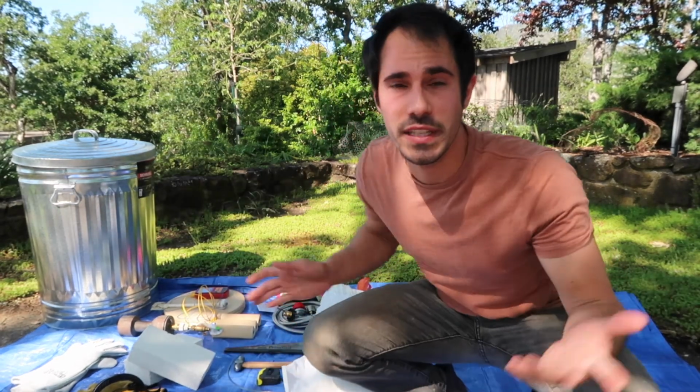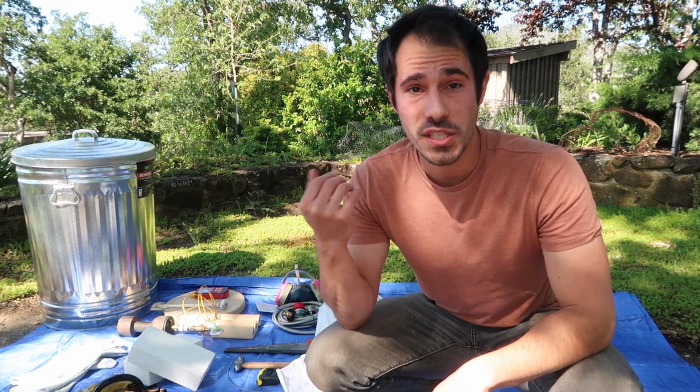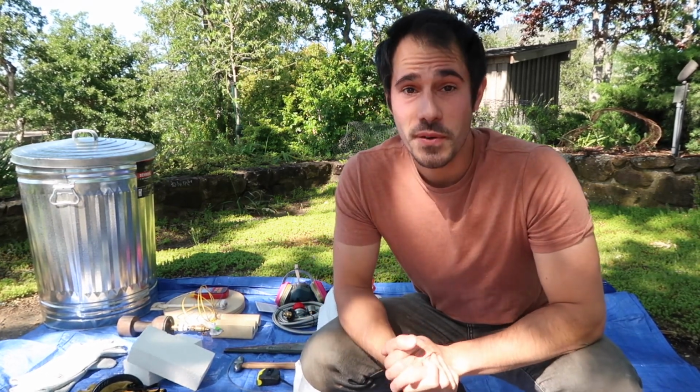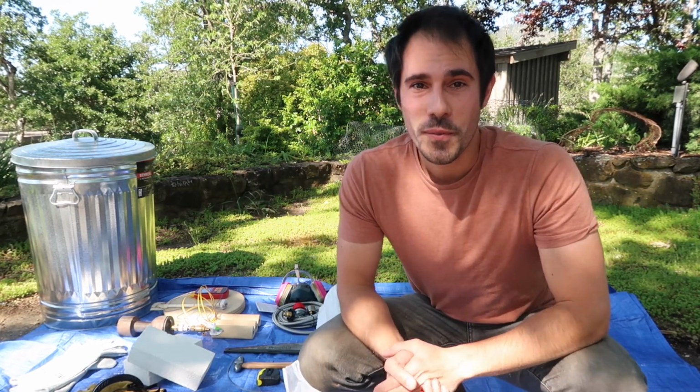Some places call it inswool. There are many different names for it, but it is fiber made of ceramic that is basically going to act as the bricks that you would find inside of the kiln, the soft brick. It's fire retardant, and it's going to hold in that heat really nicely. So that's going to be the first step, to do the measurements and line the inside of the kiln, and then we'll go from there.